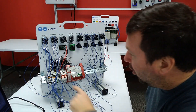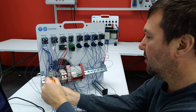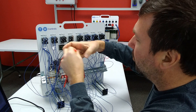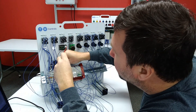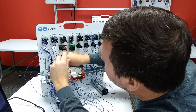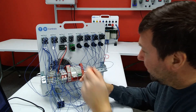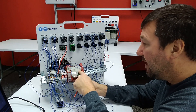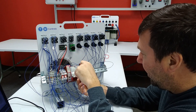Next we have the monitoring on our two safety relays. We're going to connect a wire from the plus 24 volt — our left set of terminals — to the common on our left safety relay, terminal number 11. Then connect a wire from terminal number 12, the normally closed contact on our left relay, to terminal number 12 on our right safety relay, which is its normally closed contact. Then a wire from terminal number 11 on the right relay goes to input 0 on our plug-in module. Your safety relay came with two modules in the top: one is an ethernet adapter and the other is some auxiliary inputs and outputs. We'll connect that wire to input 0, or I-00.